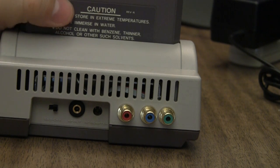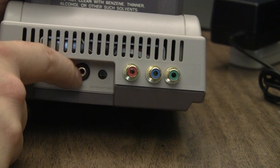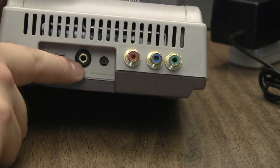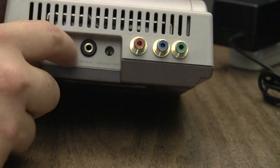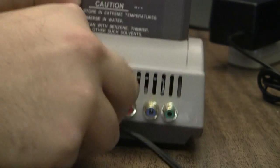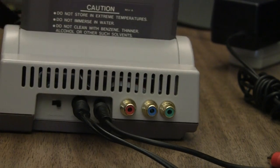But one of the ideas that I did have was to have a TRRS connector in the 3-4 channel select hole, and then have the stereo audio in another TRS connector over here. That way we just have two of those connectors. Now, I can't find the TRS connector, the stereo audio out in gray, but I do get the TRRS one in gray, which looks nice, so it would have been a bit contradictory, but we could have found another shell and left that sticker on there and then had component video coming out of the TRRS and then audio out of the TRS. So we would have had two of these sticking out along with the power. I think it would have looked pretty good, but we didn't want to fiddle with trying to find another shell.